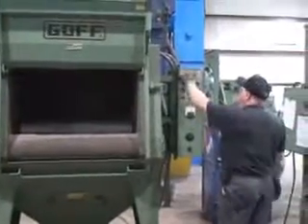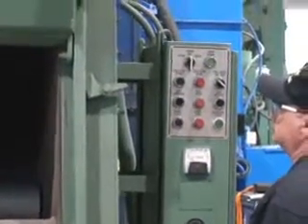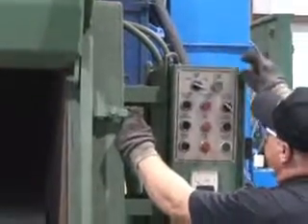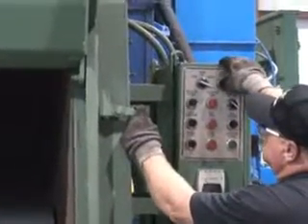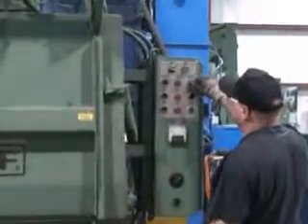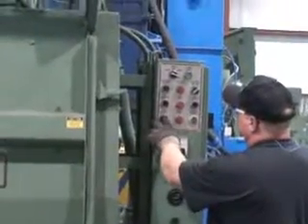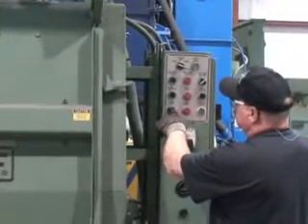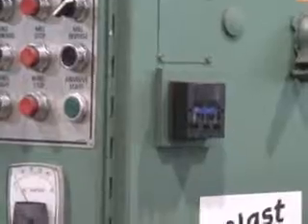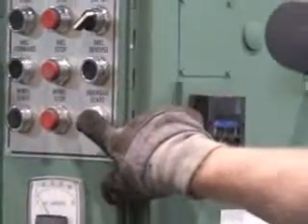The next step is to start your collector or abrasive reclaiming system. Then manually hold the safety lock switch and turn your selector switch from the door to the closed position and push the door close button. After your door is closed, turn the mill drive selector switch to the off position so your mill will not run but you can still run the blast wheel. Push the blast wheel start button and set your abrasive timer to approximately 30 seconds — this may vary depending on the media you're using, but 30 seconds is a good starting time.